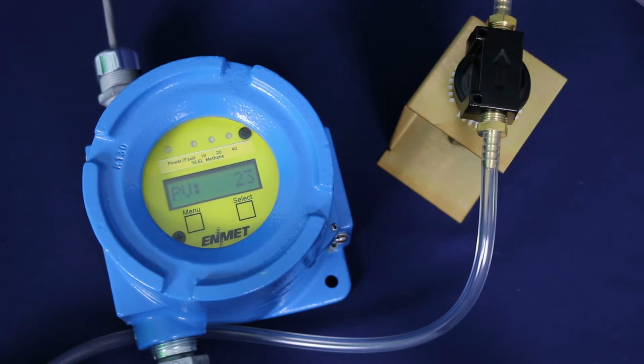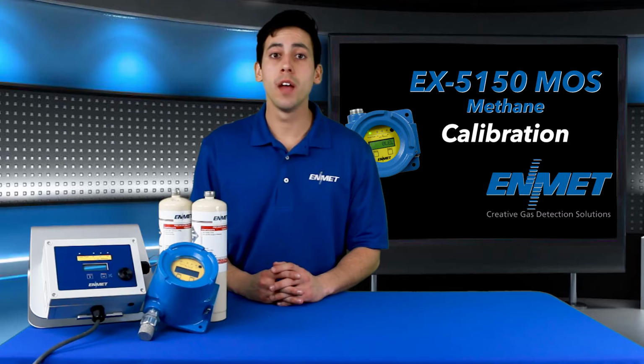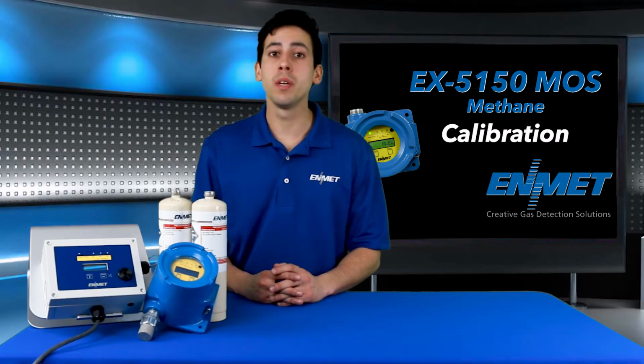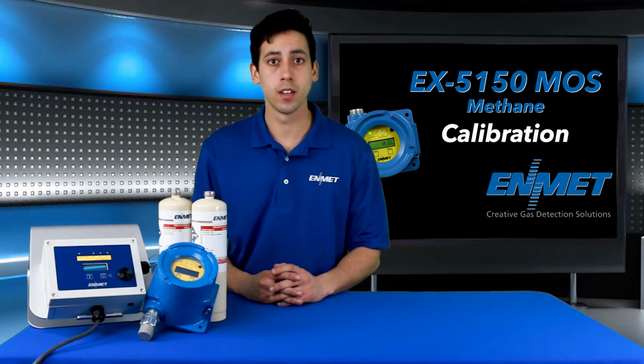The transmitter will monitor the sensor signal for stability for 2 minutes. If the sensor signal is stable after 2 minutes, the new span point will be accepted and Cal OK will be displayed, indicating a successful calibration. You will be returned to the maintenance menu with the Alarm 1 option highlighted.